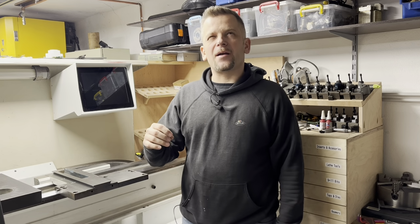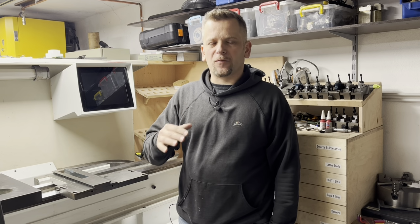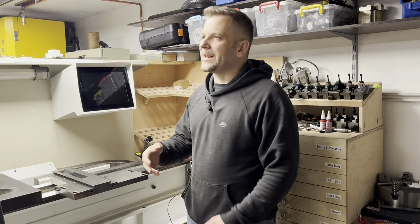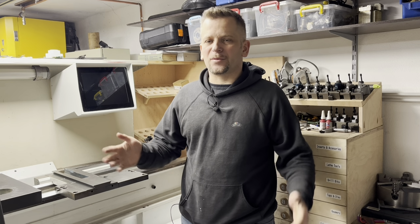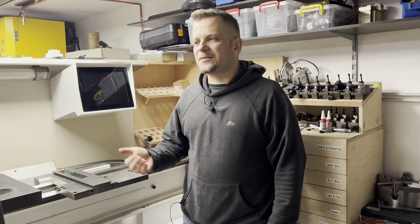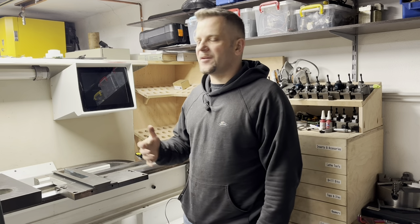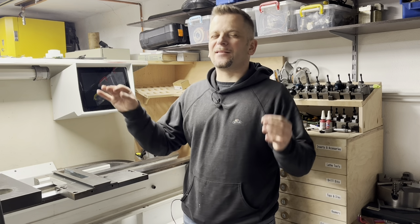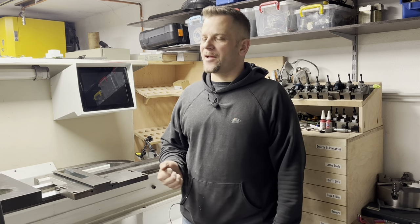Right now I have no idea, I'm confused. I have no idea why that measurement that I made on the milling machine is so far off compared to the others. I think that the next solution should be to regrind the gib on a sine table. Unfortunately, I don't have access to a sine table that big on the length, so I cannot quite regrind the gib. The second solution would be to scrape the gib in place, but I'm not very confident with that either. So I was thinking that I could be milling that on the milling machine and take a few hundredths from that end, but it seems that I cannot get the angle right, and I have no idea why.